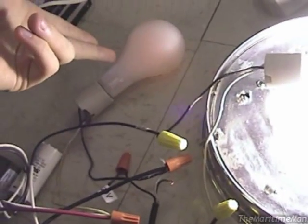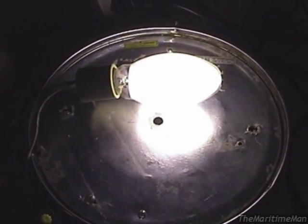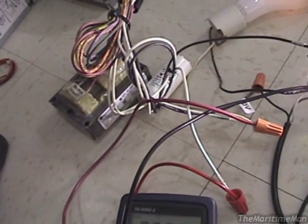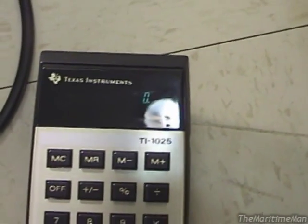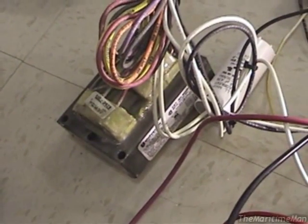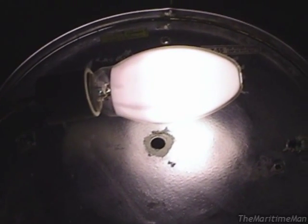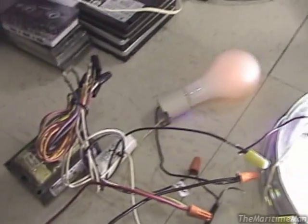This actually works really well, and it sprung me a really nice idea. As far as I can tell, this seems to work just as well as if I were to get a capacitor and put it in series with the mercury vapor bulb. The only downside is that because the ballast is not seeing as high a voltage, it's not providing as high an open circuit voltage to the mercury vapor bulb. If open circuit voltage is about 240 volts, then at 101 volts the open circuit voltage would be around 202 volts — and the ballast I was using before had an open circuit voltage of 200 volts. So this downside doesn't even really apply here; the bulb will have no problem at all.